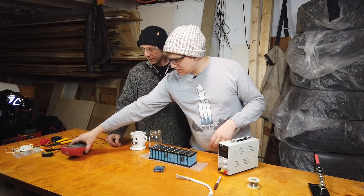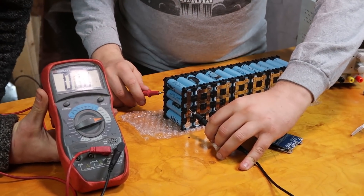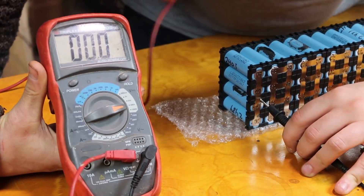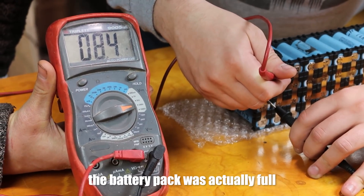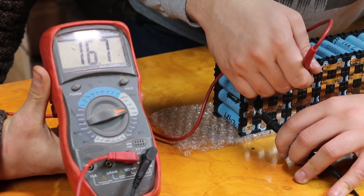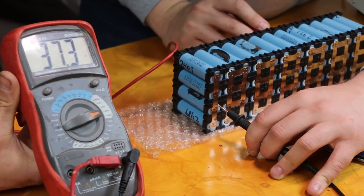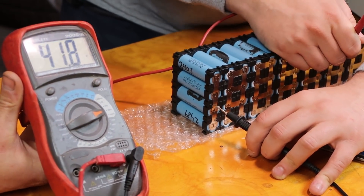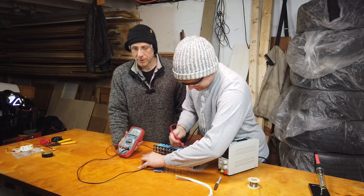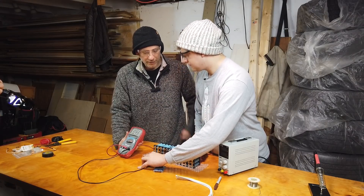It's just doing a basic thing. So if we have our voltmeter with one connection to the negative side and one connection to the positive side — across one cell — we get 4.2 volts. Then if I go to the next positive side over, we get double the amount. And so this allows me to check the voltage of each of the different steps of the pack. If I saw that this was lower than expected, that cell group needed a little more. Well, it's actually checking for high — if something's over, it'll use a resistor to take down some of the power.